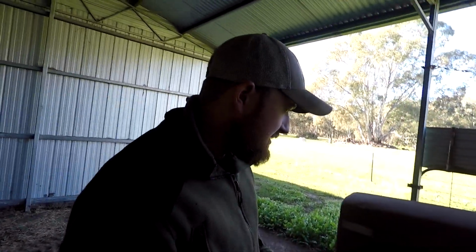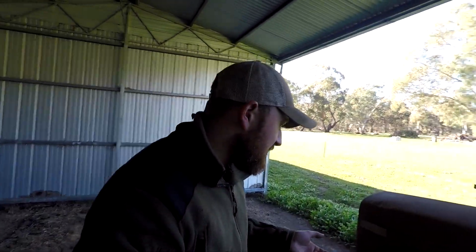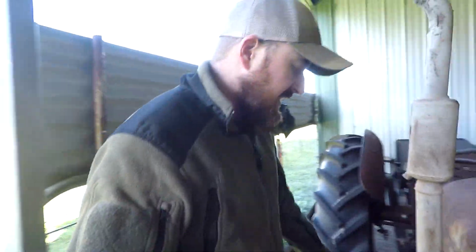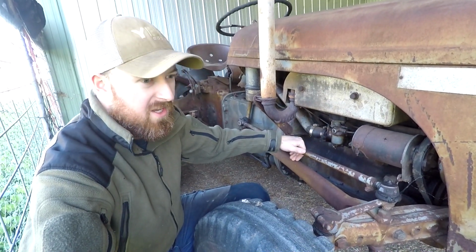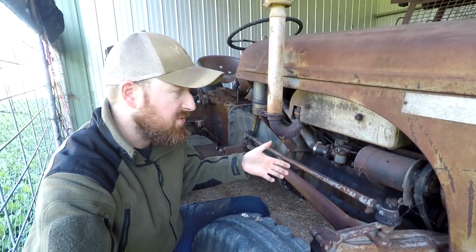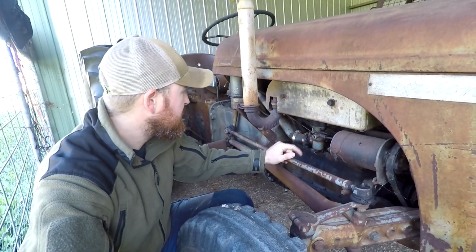And the tractor, which you haven't seen yet. I think I mentioned it in one of the 135 videos. This is a grey Fergie, so this is a TED20. Originally the TED, the difference is they have an extra shroud over the intake and exhaust, because they wanted to be able to run on a higher flash point fuel, like your kerosene and all the rest of it, so you need to be able to preheat the fuel and vaporize it more. I think they even ran on paraffin, something along those lines. So yeah, that's the TED.